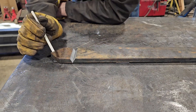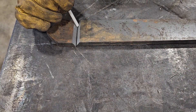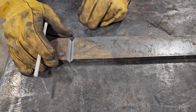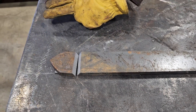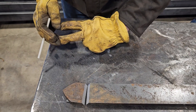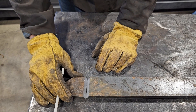When we start we're actually going to want to start with a couple of tack welds — one on this side, one on that side. The reason why we do that is as we are welding across, it keeps the material where we want it instead of opening up. If you don't tack weld and you start on one side, as you move across the metal will actually separate and then our weld is going to look crooked at the end, and we want it to be straight.